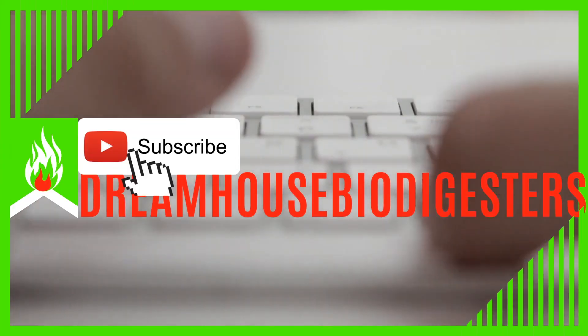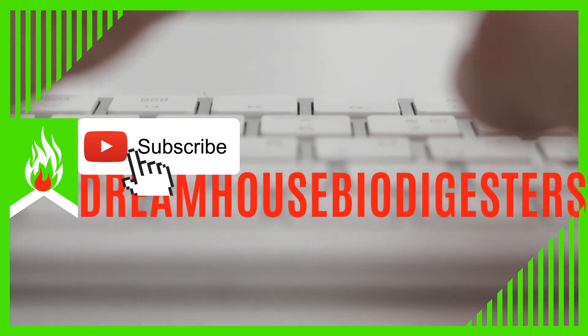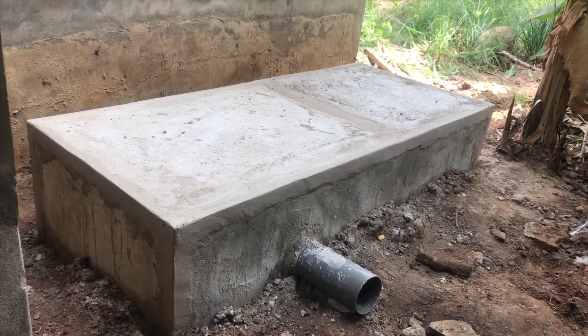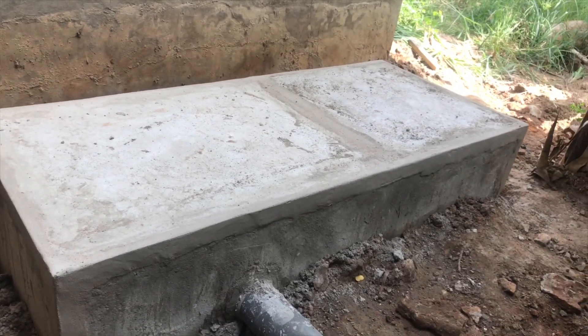Now let's go inside and have a look at the toilet room. In this particular house the toilet seats have not yet been fixed — the pipes are on the ground and the tiles have been done. The issue is that it's always best to ensure your digester is installed before most of this finishing work is done. Once you come into the room and the tiles have already been fixed, there is little you can do if you need to change the seat type, as it may affect the wall tiles. Always advise the homeowner to install the digester before tiling — the digester should not be an afterthought; it should be part of the building process.